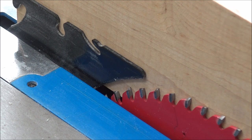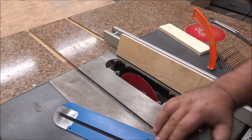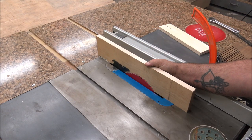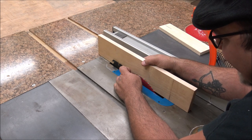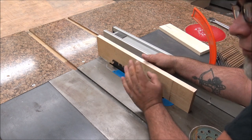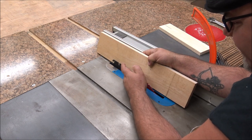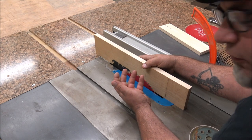One more thing before we call this video quits: the riving knife. I like to keep my riving knife nice and clean — I'll typically clean it up with a bit of sandpaper and then wax it. I want to be able to put a very flat piece of wood up against this side of my saw and have my riving knife just past that. When you push on it, the riving knife moves just a little bit — less than five or six thousandths of an inch — so it's just to this side of the blade. What that does is effectively create something of a feather board of sorts.